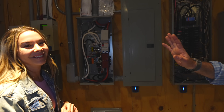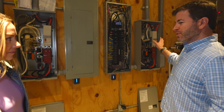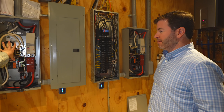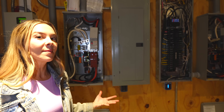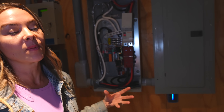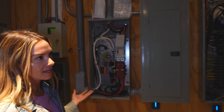That's where the solar comes down. The feeds coming out of it — when we swap these automatic transfer switches for the backup controllers — will provide power to charge the batteries. You already had these because you had it set up for a generator you were thinking about getting, but you decided to do the battery instead. These will take the power coming from the grid, and if the power ever goes out, you can transfer it to the battery instead.